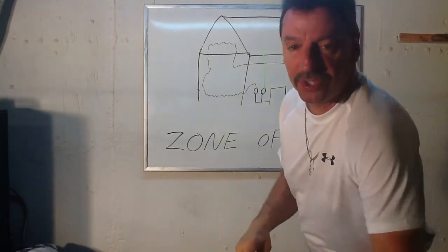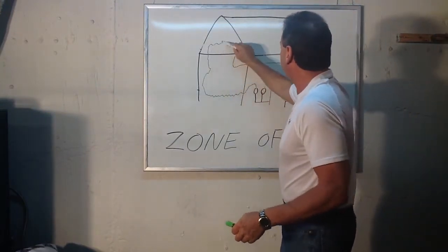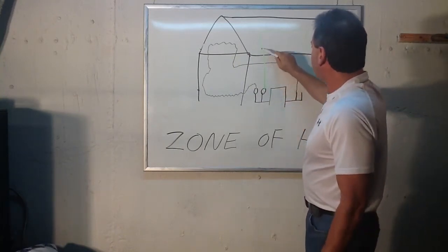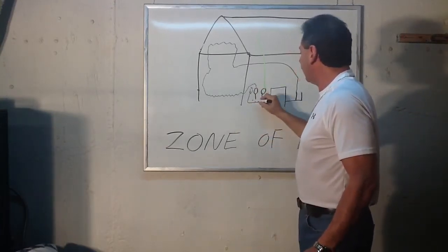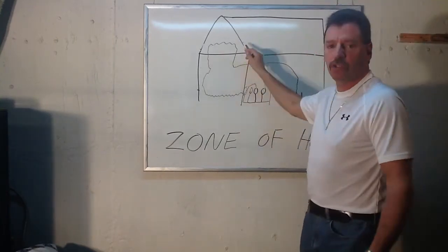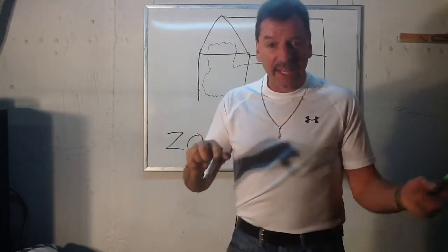Now by cutting it into two zones, the water only has to make half the trip and back. The second circulator takes care of the other half of the house with the second zone. If the house is really large, you can add a third zone, a fourth zone, and so on, so the water takes very short trips back to the boiler and maintains its 180°.